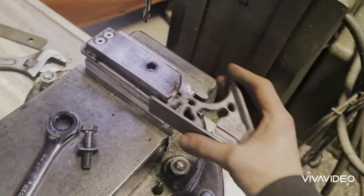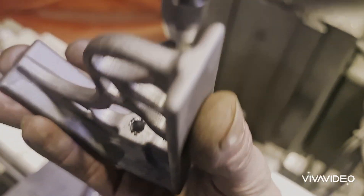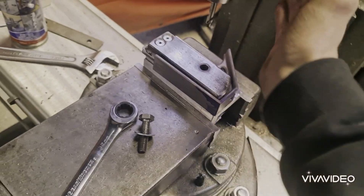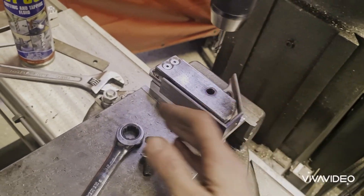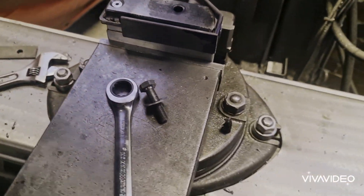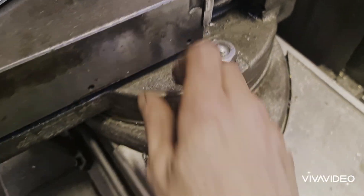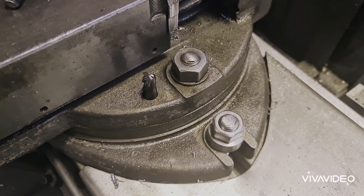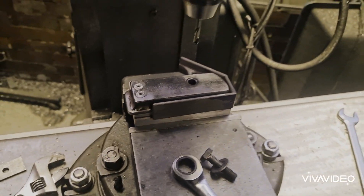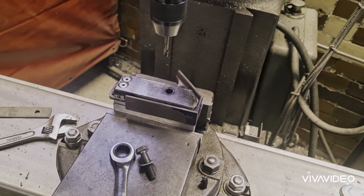Let's just check that hole drilled in the middle. Very nice. So now we have to re-jig it back up and we're going to swap the drill bit for an end mill and then we're going to face all three planes. What we've done is used a calibrated device and drilled and reamed it with 12mm, used a solid carbide end mill so we can lock it up exactly the same every single time, and we'll fine tune them on the belt sander. Stay tuned.